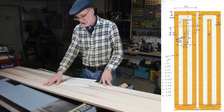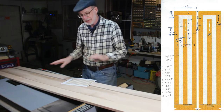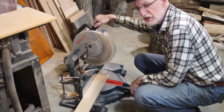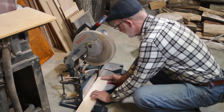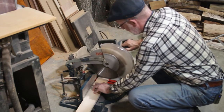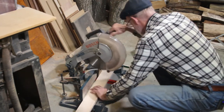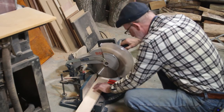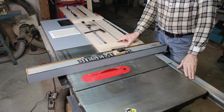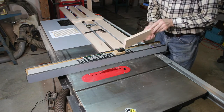The rest of the boards are less important — there are going to be two horizontal cross pieces about 15 inches long that can be plain wood. I'm going to select these areas, mark them out, and make my first commitment cut. I'm going to get this board set up on the chop saw right at my mark, and make cut number one. Before each cut, I check each side for unevenness or rough edges and decide which side to cut off.